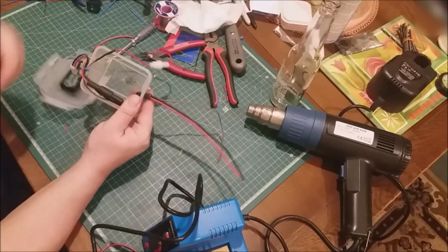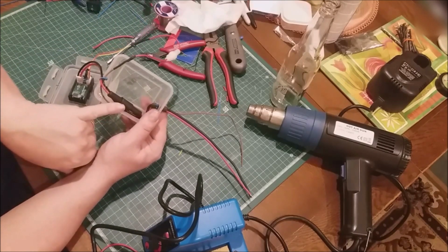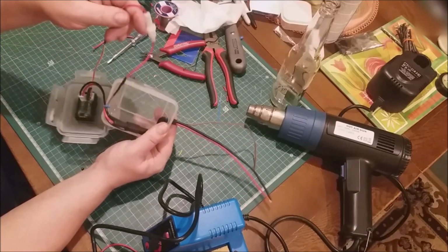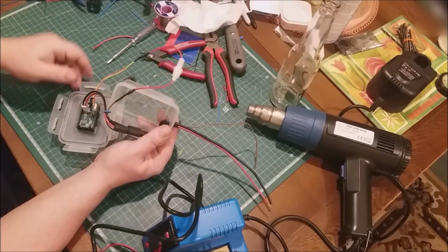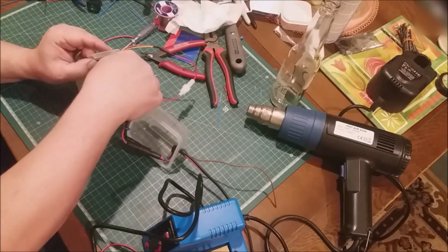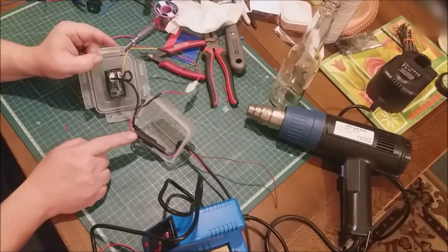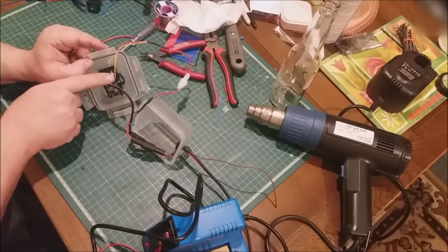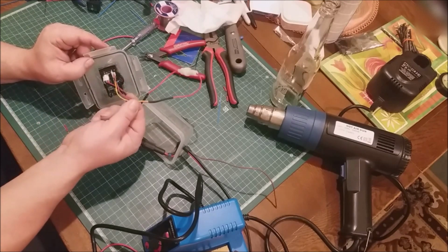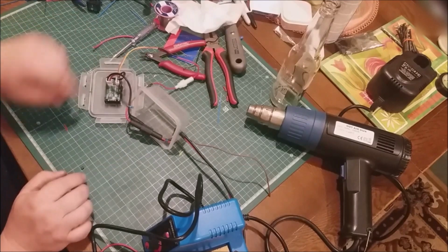And then this here is the live supply with a 50 milliamp fuse. So this one's fused at 10 amps, the same rating as the ammeter is capable of, and this one's fused at 50 milliamps because that's actually on the voltmeter supply. Because the voltmeter is picking up its supply from the neutral of the ammeter side of things, I don't need to take these wires through separately. I can join the yellow and red together at that point, but you'll see that on the drawing.